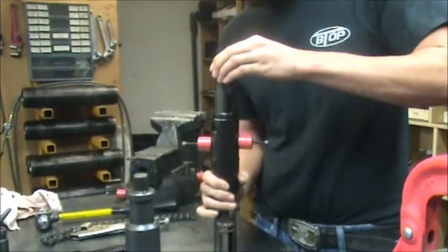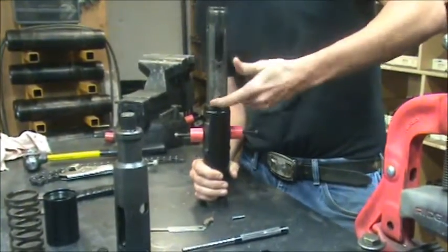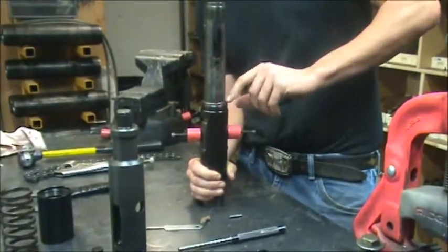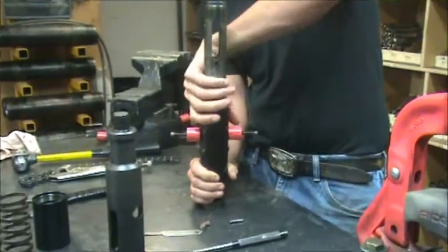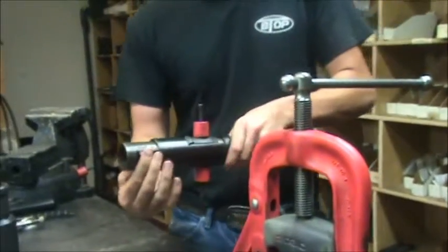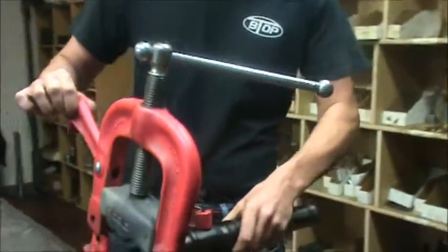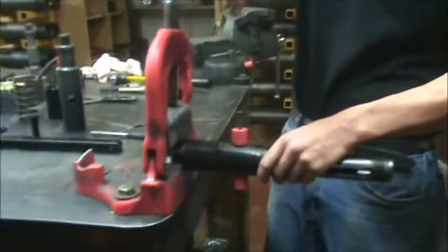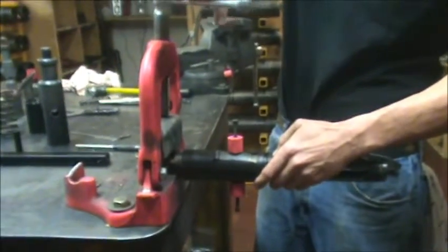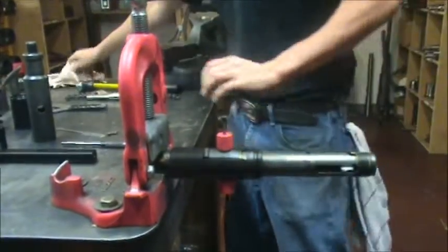Slide it down slowly, even with this shoulder. You don't want to pass that shoulder too much — it'll lock up on you. You want to keep it easy on the side so your lug segments don't fall out in the middle. Step on the front, push it up against, make it as even as possible. Pull it back a little bit — a quarter of an inch or so — to give you some room.